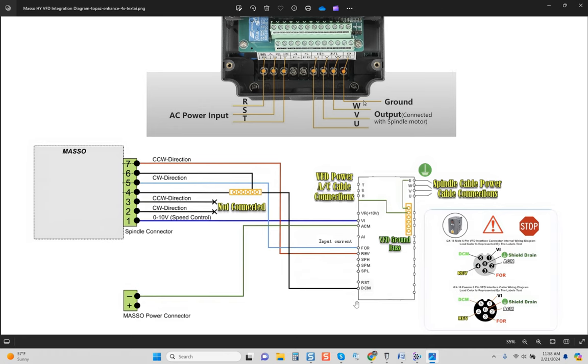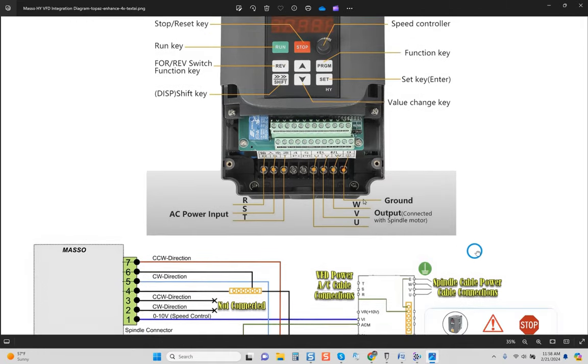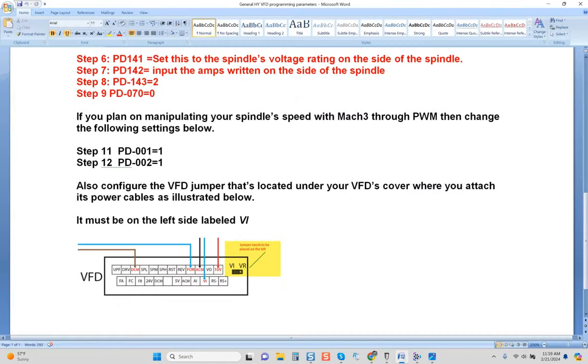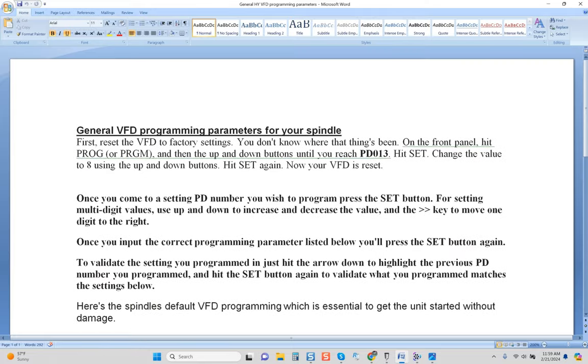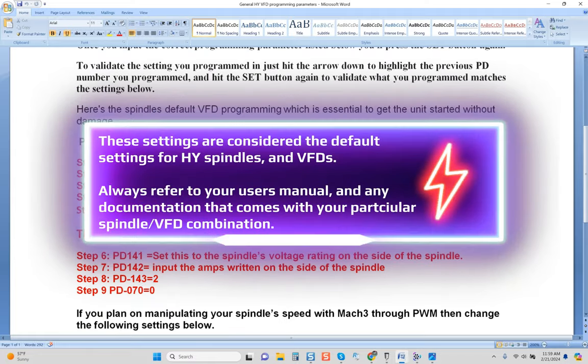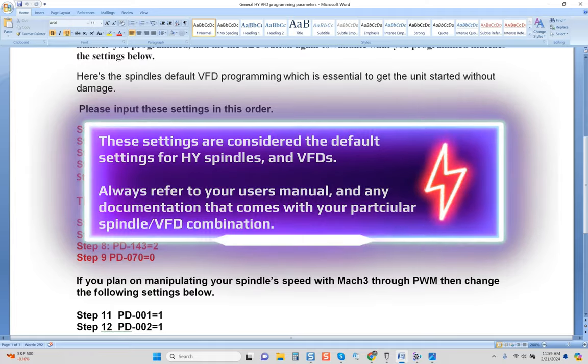This diagram also shows the functionality of the VFD including the shift key, value change key, and all that. This should have all been explicitly included in the wiring diagram — I feel it's going to help many of you, and this is a better diagram overall because it shows how easy this can be set up. The more time-consuming part is the terminal splitter and installing a VFD ground bus bar to split the earth ground, since we only have one single ground on our HY VFD.